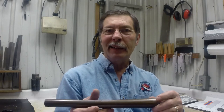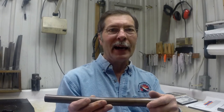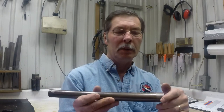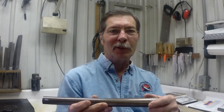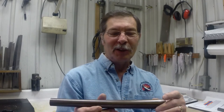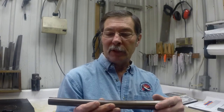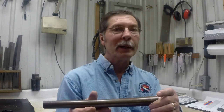During the forging of my barrels and trying to use my old trip hammer, it became a little bit frightening. In order to get that hammer to hit hard enough to move the material, I had to run the hammer at a very high speed, which means a lot of impacts per second, per minute, whatever. It really became almost uncontrollable because the hammer itself, with all those high-speed impacts, virtually ripped the tube out of my tongs, and I had a hard time holding it. So I'm interested to see how this goes and see if this is easier to move. If it is, I feel that it would only confirm that it was not a difficult process for blacksmiths to forge shotgun tubes down to smaller diameters and turn them into pistol tubes.